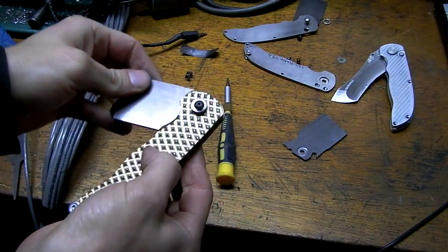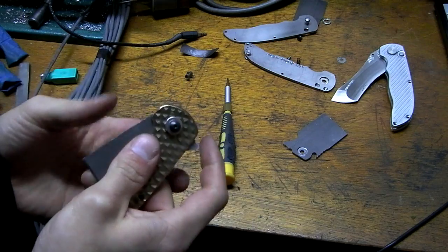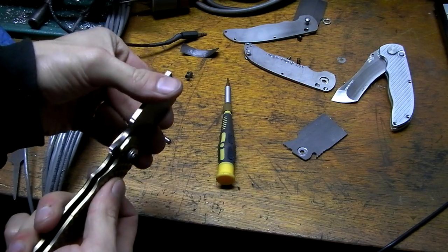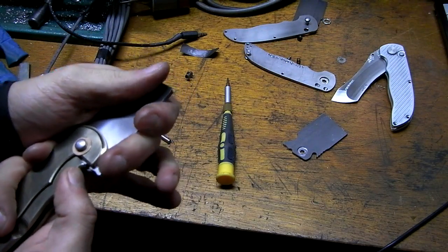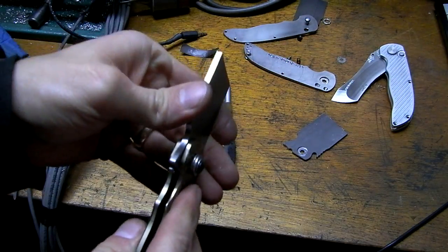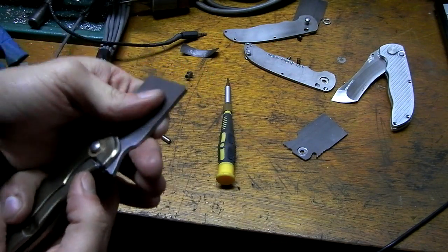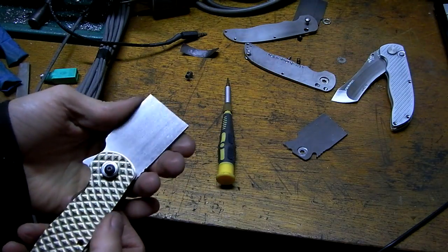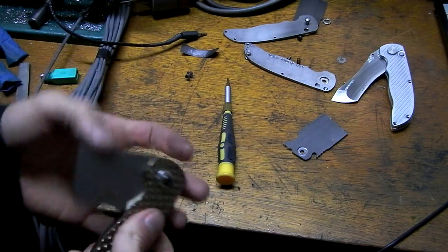Okay, good and bad. Detent feels good. New detent location, I like it, but it's tight for some reason. And my detent ball easy groove is good and bad. And it still doesn't lock up a bunch. I did carbonize the face of the lock bar, so I wonder if that added a lot of thickness. And it doesn't quite reach in there and lock up enough. So, pluses and minuses. Got to keep dinking around with it, as always.